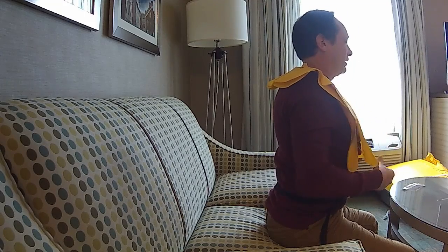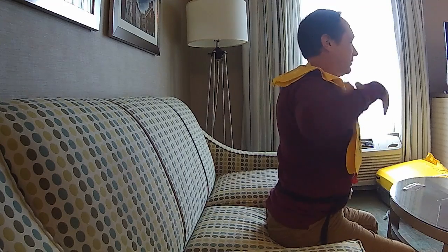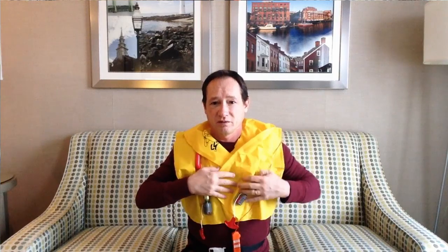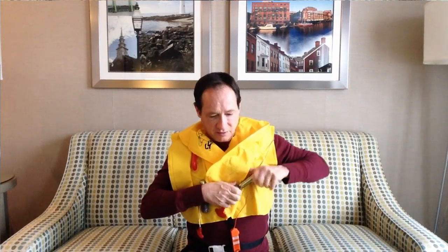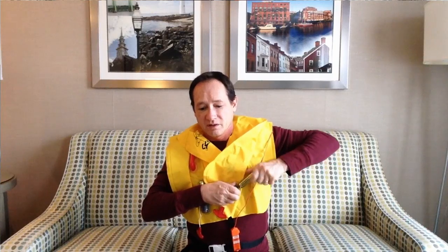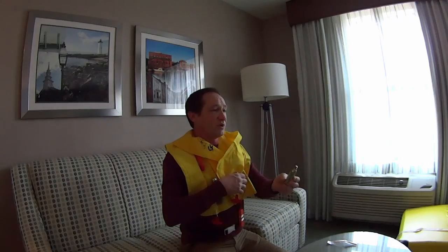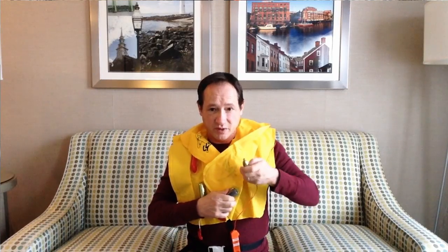When you get to the door, they don't want you to deploy these in the aircraft because they'll inflate and be kind of puffy. When you get to the door, what you want to do is pull down on these two handles. What happens is that will drive a pin up into this little cylinder — this cylinder is actually a CO2 cylinder, like you would use in a CO2 gun, a paintball gun, or a CO2 BB pistol. The pin in there will drive up and puncture the end of it.